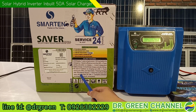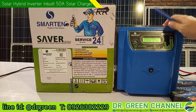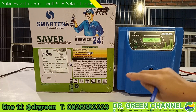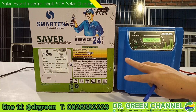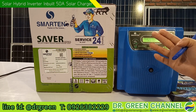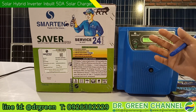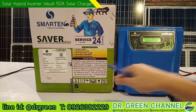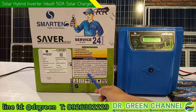Sharing charging with solar and grid, and also genset, is also managed by the microcontroller, so it will help to choose whether to use the solar, or if the solar is insufficient to produce the power for the load, it will combine solar and the grid together. And of course this can also work with the genset.